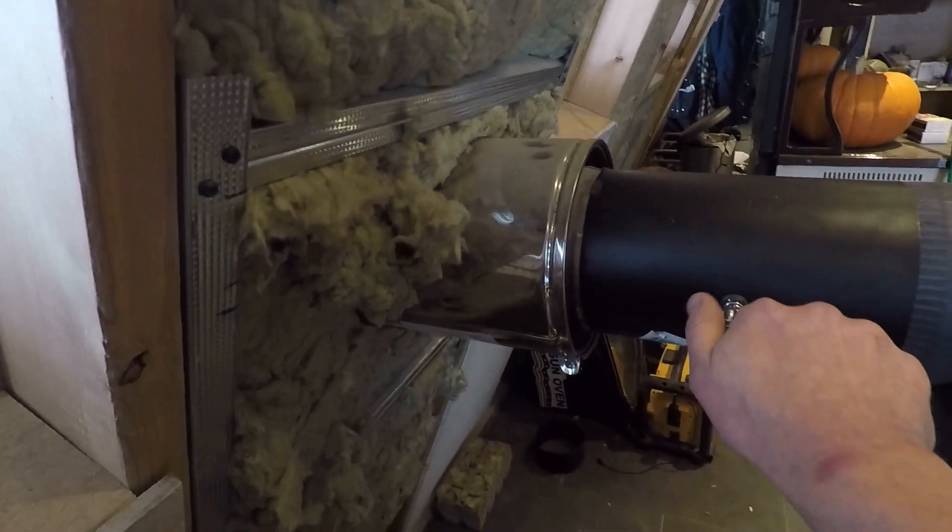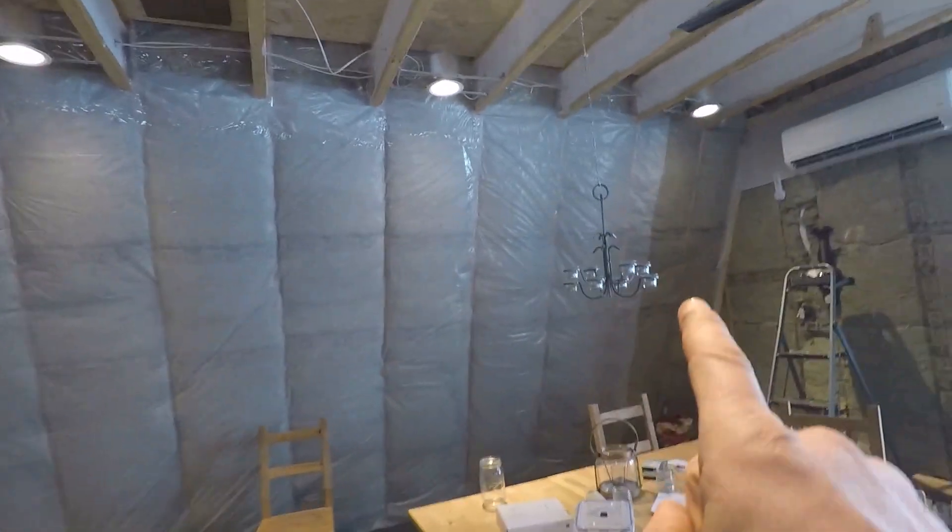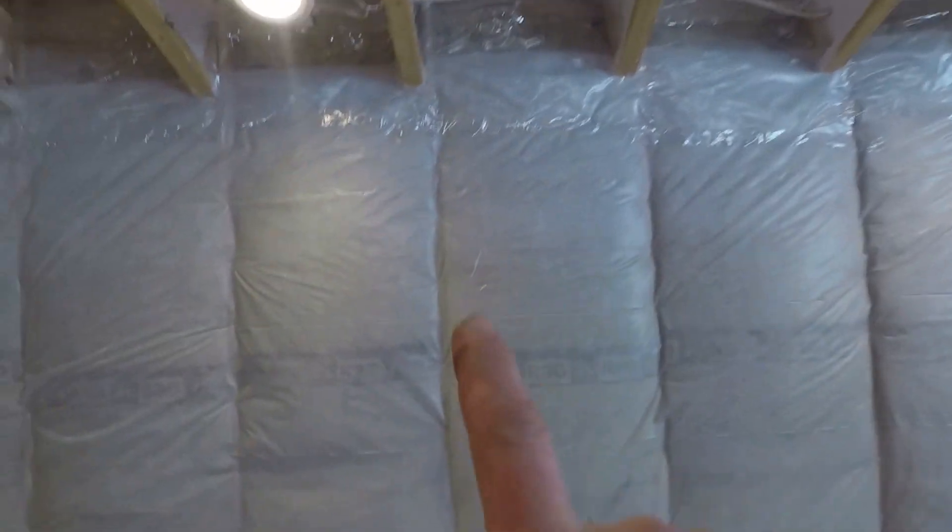That's open. That's closed. And the main reason for it is the splits are working and the stove works fine enough. It's my thermal envelope. You can see that I have all this plastic, the vapor barrier. I have all the insulation behind it. But I didn't have the vapor barrier on, and this wall was just really cold — you could feel cold air coming through between the insulation. And it was just sucking all the heat out. So I've tightened everything up on top. It goes all the way up now. The air travels from the bottom of the soffit all the way up 37 feet to the ridge cap, and then out.